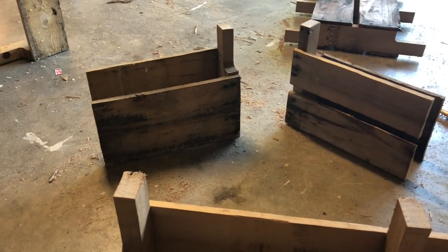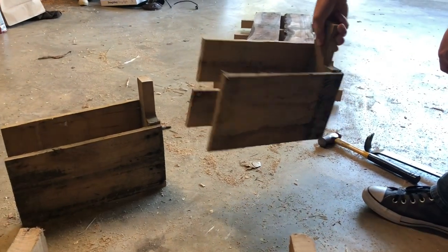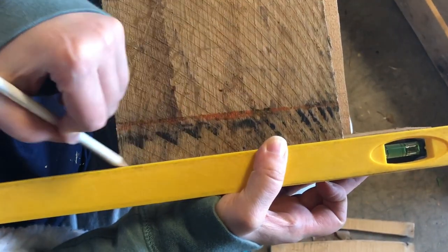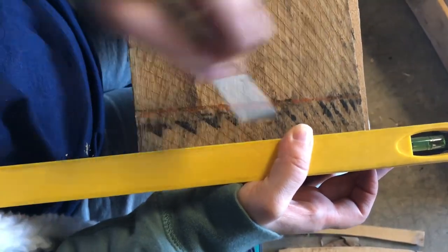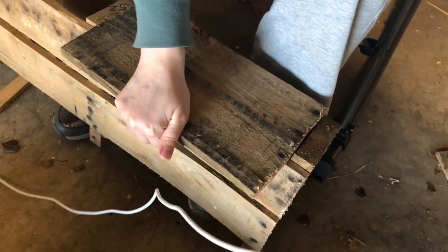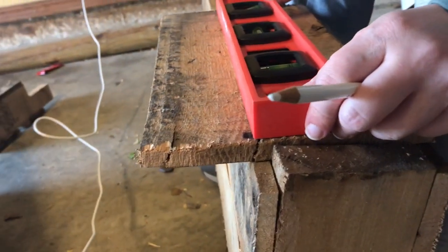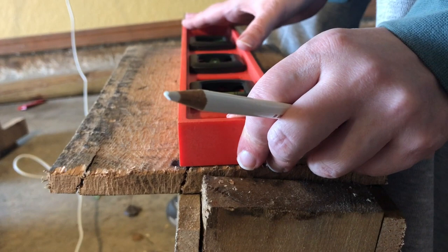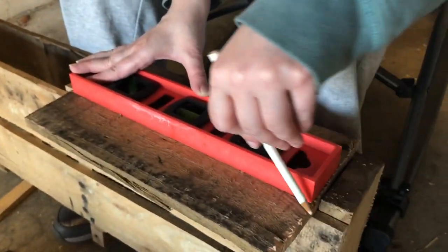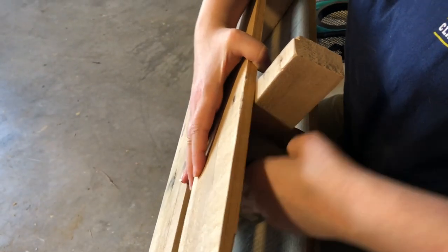We ended up with two shelves out of one pallet. We cut the ends off each one to make them shorter, and all we needed to do was cut some boards to screw into the bottom part so the books don't fall out. For the first shelf, we used the bottom boards from the wood on the ends we cut off. For the second shelf, we dipped into the leftover pallet wood. It was getting darker so I switched to a white chalk pencil and traced cutting lines so they were easier to see. We turned the shelf upside down, placed the board flush on each side, and traced where we needed to cut. These are not perfectly even, as pallet wood is already kind of janky — we did the best we could and chalked up the unevenness to the rustic look.